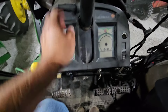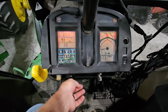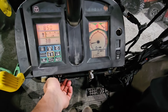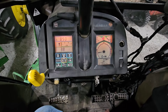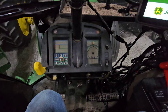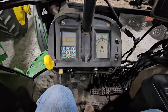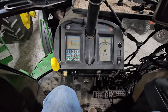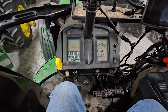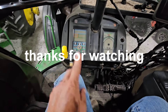It's not safe when you don't have turn signals. Still won't work — no turn signals, nothing on the dash, nothing outside. The lights work, so I don't know. I'm stumped. I really don't want to replace the tach because it's going to mess up my hours, and a tach from John Deere is like $3,000. I want to make sure that's for sure the problem before I spend the money. If anybody's got any ideas — I can't seem to find any information. Everybody says it's in the fuse panel, but I've been there, done that, and that's not the problem.